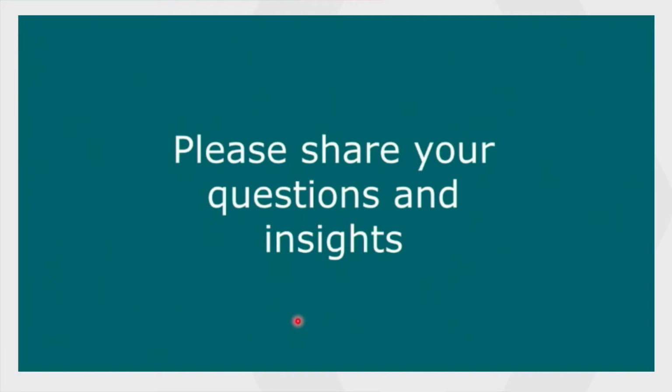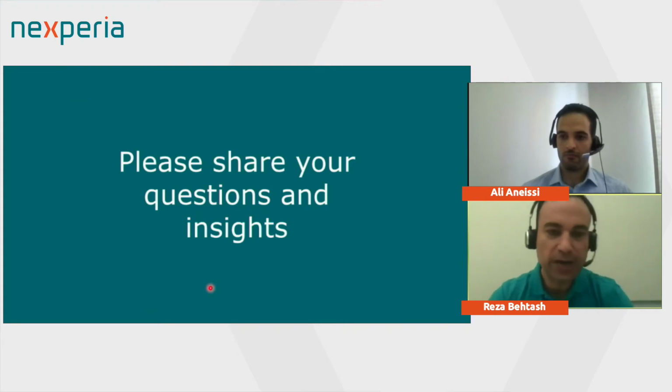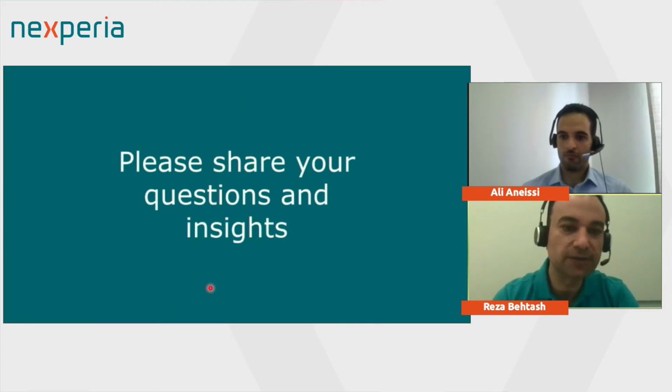So I think this one is for Reza. What are potential applications for silicon germanium rectifiers? Okay, this is a very good question. So I think the first one is very obvious. As mentioned by Ali, we use it in a converter, in a high frequency converter. And you see the advantages coming from the efficient switching behavior. So everywhere where you need a high thermal robustness and low leakage current, combined with a high switching frequency, is the right application for silicon germanium.